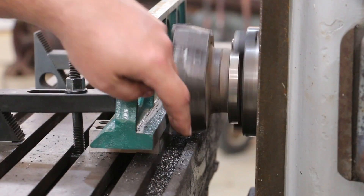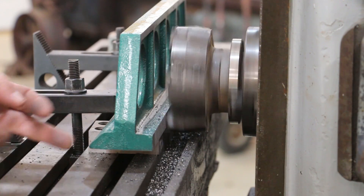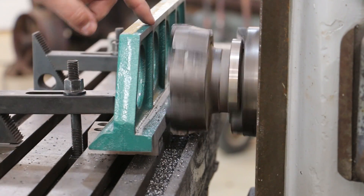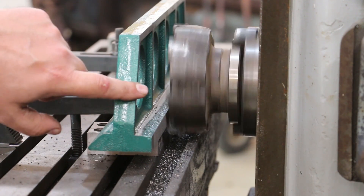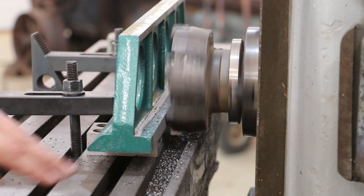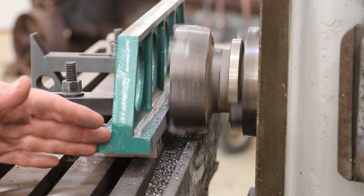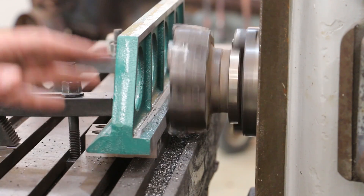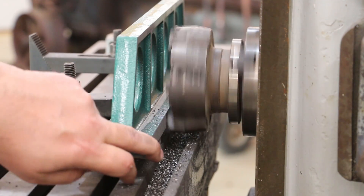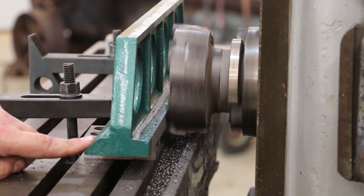The next step on the mill here is machining this surface on the back square with the bottom. We're sitting on some 1-2-3 blocks again, got it clamped down. Since the back surface is now machined, we used that as a measurement reference to the milling machine to set it up so these should be fairly parallel. I'm not worried about them being exactly parallel — I would say probably within at least a thousandth of an inch the way we set them up. Once this is done we'll have to come in and do the 45 on this side.